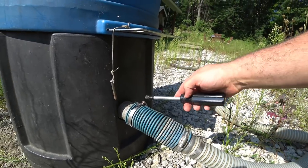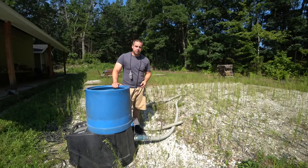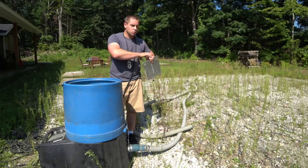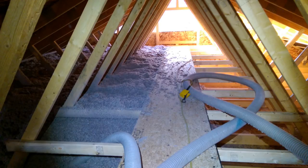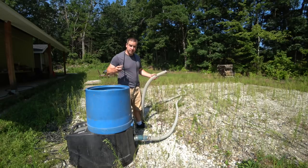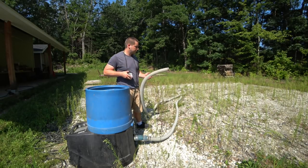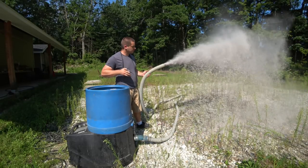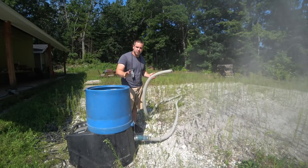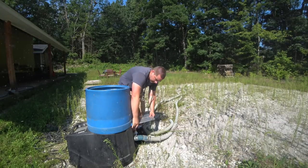Go ahead and attach your hoses to the machine and make sure you tighten them up with a nut driver — works better than a flathead. I've got the remote here over my neck so I always have it close by. I'm going to demonstrate what happens if you take the feed gate completely out. The only situation you would want this is if you're wide open in an attic, and you don't want anything smaller on the end of the two inch hose. First I'm going to turn on the agitator, then I'm going to turn on the blower. This is wide open — you can see how much material comes out very quickly.